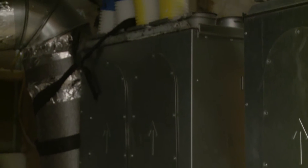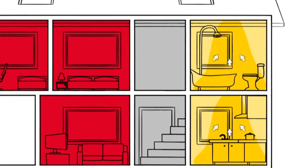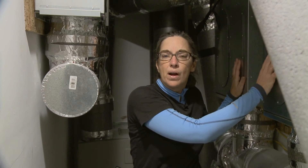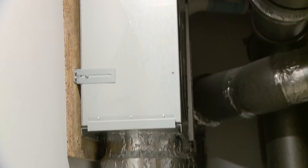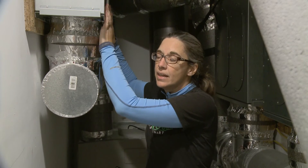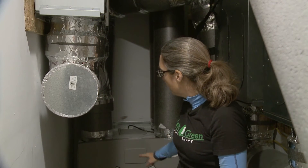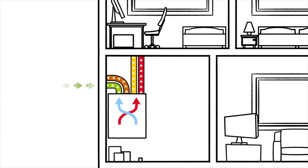In this case, it's a pretty large system. You will see tubes above me. All the tubes on this side of the house are collecting air from rooms — bathrooms, kitchens, mechanical room, the room I'm standing in right now, the laundry room — all the rooms that would have humidity and also have smells or other fumes that we would want to expel from the house. On the other side, there are tubes going out that supply air to every other room in the house: the bedrooms, the living room, the dining room, the TV room. So 24 hours a day in those rooms, you are receiving fresh air from outside, but it has been tempered because it has been run through this machine, receiving the heat or cool from the air that is leaving, filtering through and bringing that good air in at a better temperature.